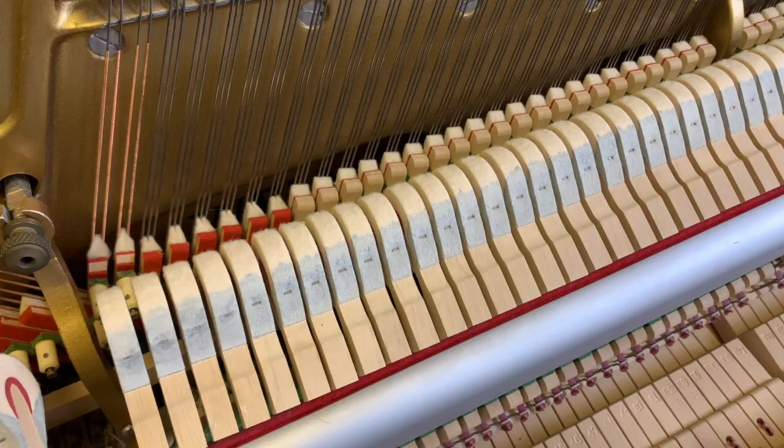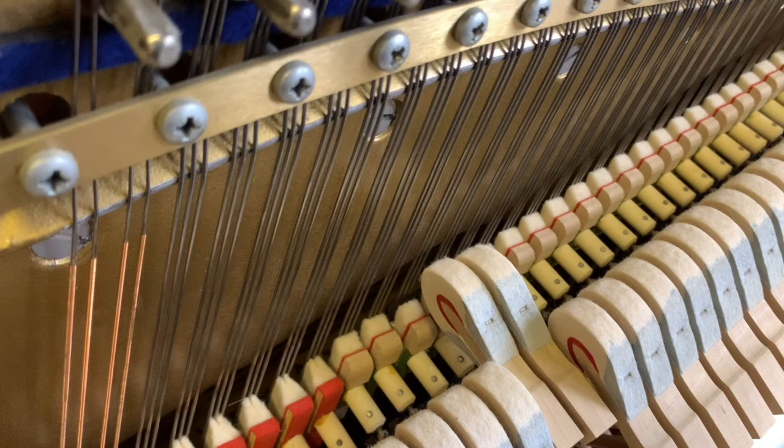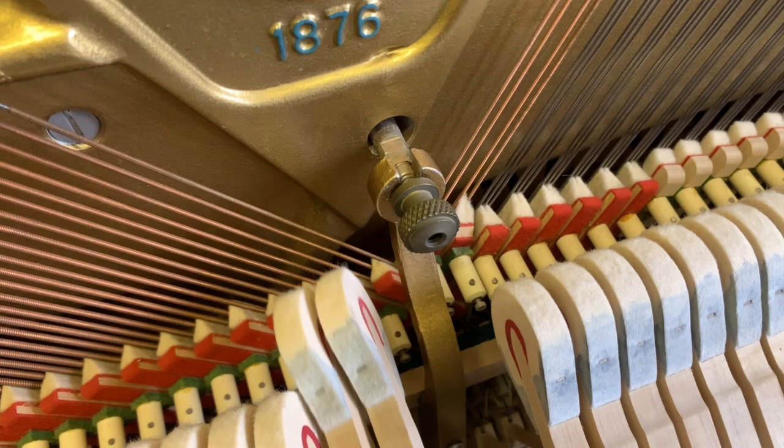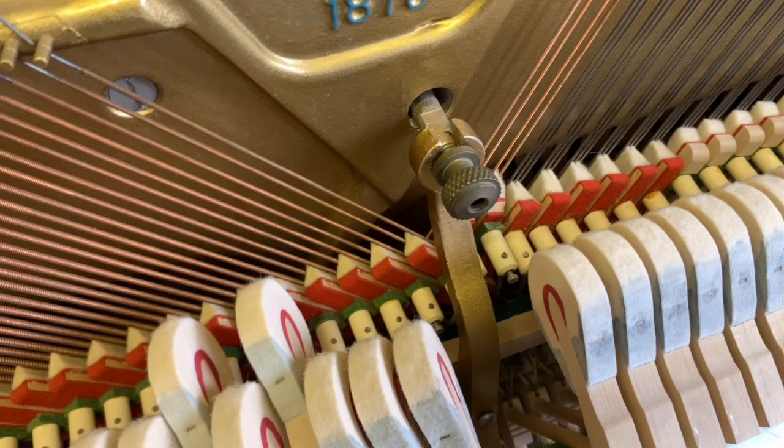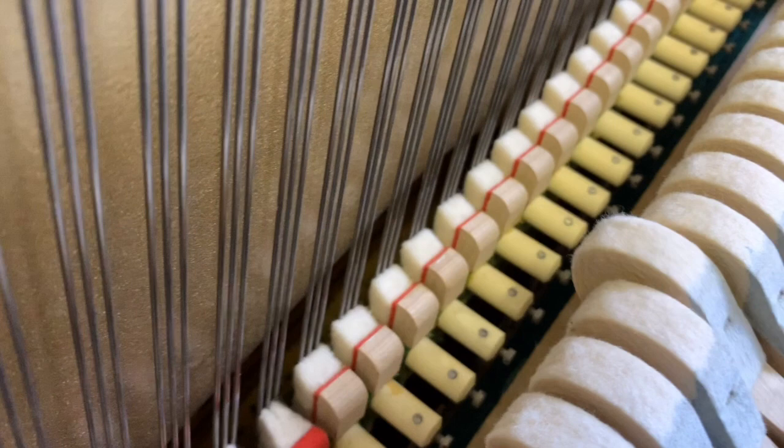The regulation on the piano is generally very good. Looking at how the dampers are coming off halfway to the string — that's just very nice. The bass dampers are slightly later, which is better because they're heavier, so they're not impeding the touch at all. The set-off — how far the hammer gets to the string — is about three millimeters, which is almost exactly right. We'll have a look at that, but it's pretty much as we'd like it to be.